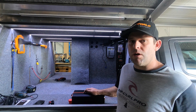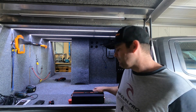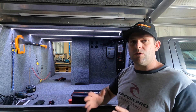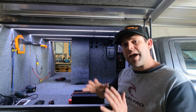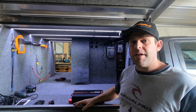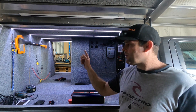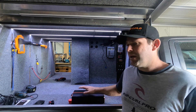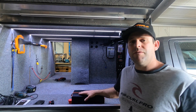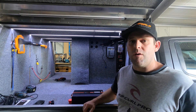If you're not sure what an inverter is, I'll give you a brief overview. You've got DC power which is in your car or anything with batteries — DC stands for direct current, one way. Your power lines that run to your house are AC power — AC stands for alternating, back and forth. This device takes DC power from your car batteries or your alternator and converts it into AC power, so when you're out in the car you can plug your household appliances in.